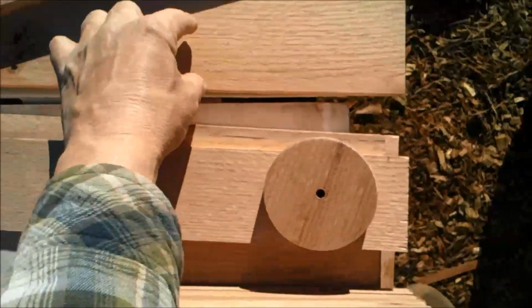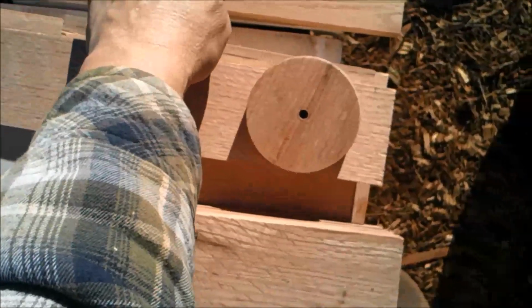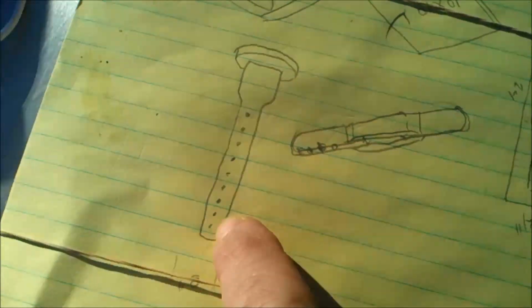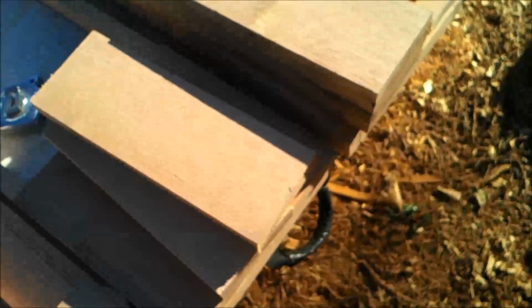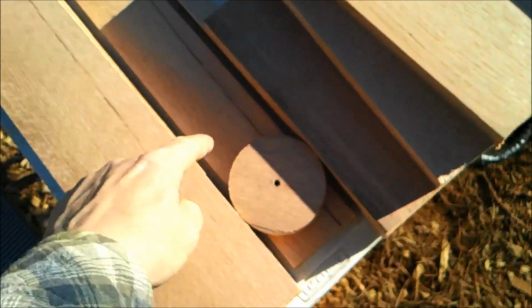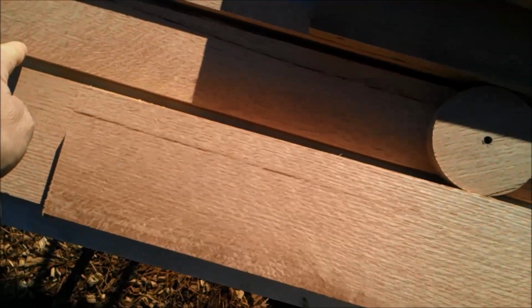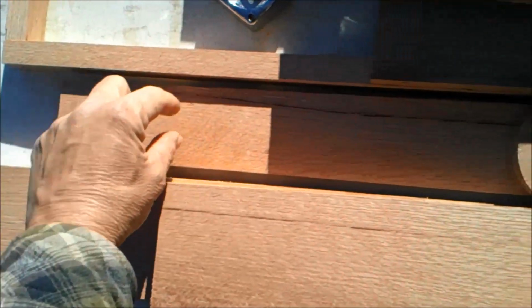We'll band it or gusset it, what I want to call it, with the 1/2 inch material on either side of it, like I showed you in the drawing, so that you have a gap there for this piece to go through. And then we got to mark and drill this. So I have multiple holes for different heights of different press locations, and I have to narrow this down. So I'm going to trim off of here and get that shape.